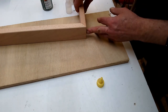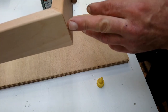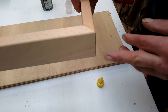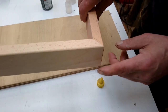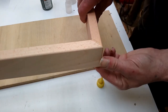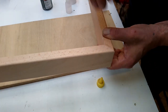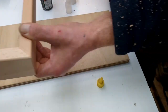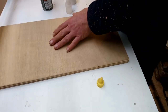See, it's not perfect — there's a tiny little gap there. I think that's because the blade's blunt on the saw. That's what you get doing it on site and it looks a bit crap. But doing it this way and spraying it round, I can fill that if I need to. There's a little gap on the top there — sometimes the wood's a little bit cooked. Doing it this way you get a better finish in the end.